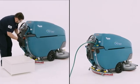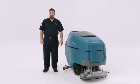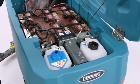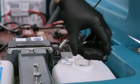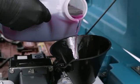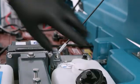If your EC Water NanoClean machine is also equipped with a severe environment switch, you can apply detergent on demand to problem areas that may have heavy oils or other soils that require a detergent to clean effectively. Before you start, make sure the severe environment detergent tank is full of your preferred undiluted detergent. To do this, open the recovery lid and fill the tank with detergent. Be sure to set the dilution ratio knob according to the instructions on your cleaning product.